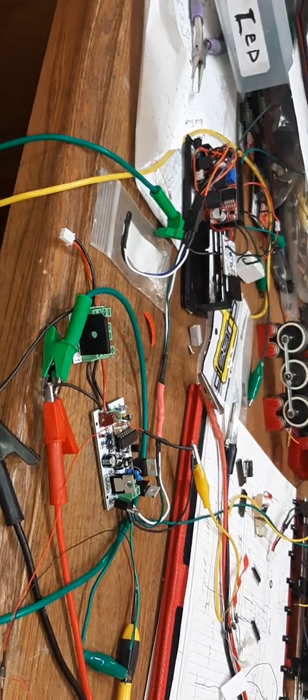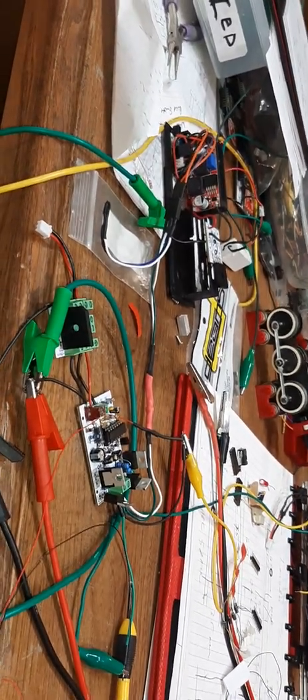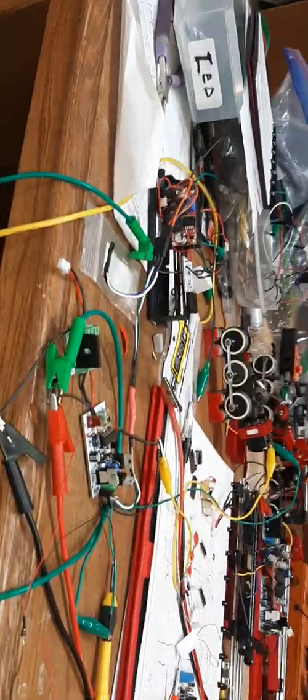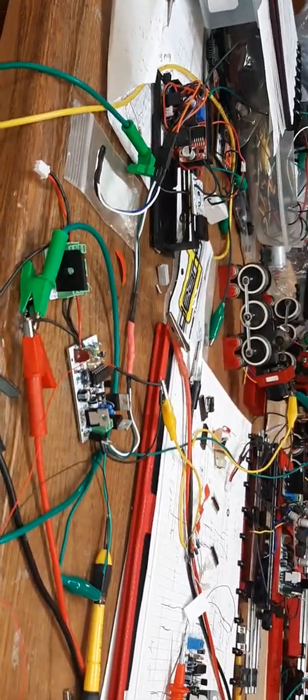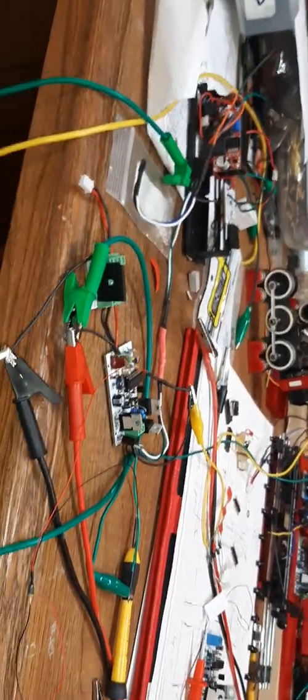I make a cover, like a shroud, like an eyebrow on a '57 Chevy. So in brass, so it's circular, and it has a little eyebrow that sticks out, and then I scallop it, make some nice shapes, and then I put the backup light right in the middle of the tender in the back, and then on either side I have the red warning lights. So we'll have lights in the back. The reds are on all the time, just like the greens are on all the time in the front.